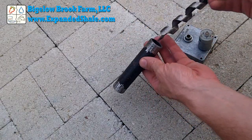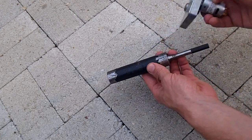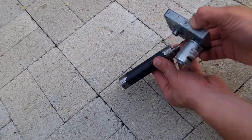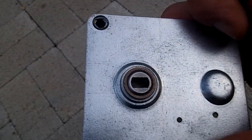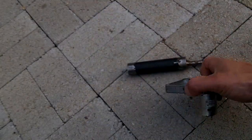The feed is controlled by a regular 3 quarter inch wood auger bit, and fits nicely into a housing, which is a piece of 3 quarter inch black pipe. This is driven by a 12 volt DC gear motor I got from a surplus store. It's a great motor, since it has a slot instead of a drive axle, so it's easy to make the auger bit fit into it.